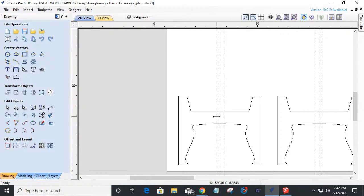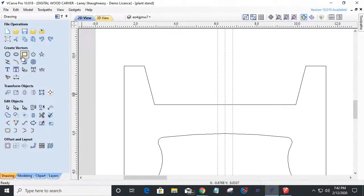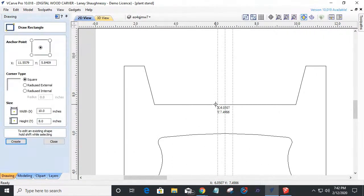Now, that's great. Now let's go ahead and create our notch. So we're going to be basically going halfway down from one direction and halfway up on the other so that when these two parts join together, they're going to be flush with one another. So it'll be flush and everything. And so I'm basically going to be creating this shape down 3/4 inch and by 3/4 inch because it's an inch and a half. So I'm going to come down to 3/4.